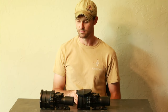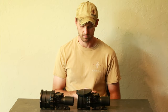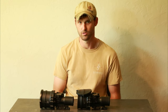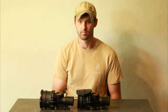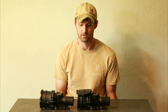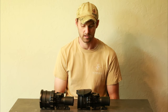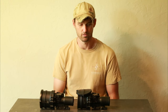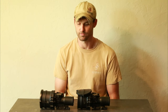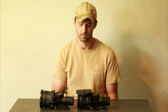The SMB filters for these — I'm sure you've seen the SMB filters we're using on PVS-14s. They greatly improve the looks of your tube, especially if you have a lower signal-to-noise ratio tube; they seem to increase the signal-to-noise, though they don't actually increase it — they just make it look better to the eye. We're even using SMB filters on high-30s signal-to-noise ratio tubes because it always helps, but it greatly improves lower signal-to-noise ratio tubes.